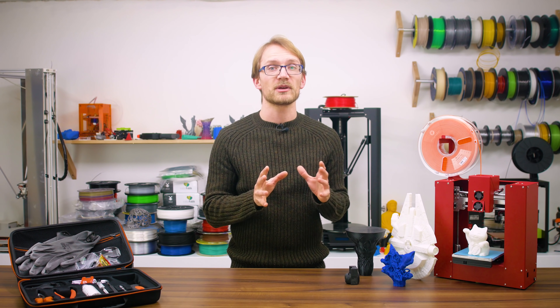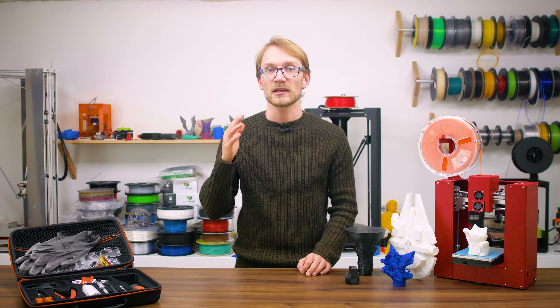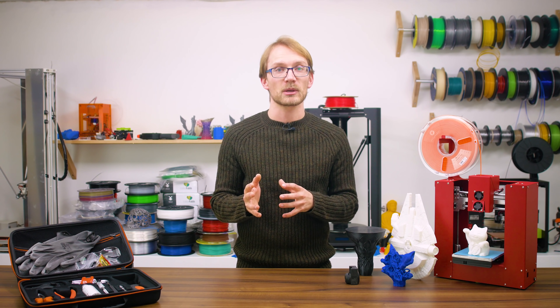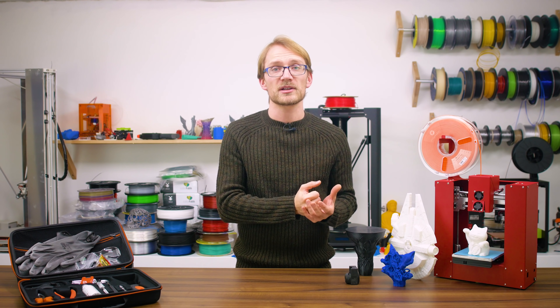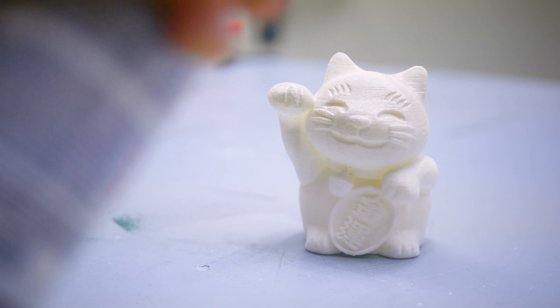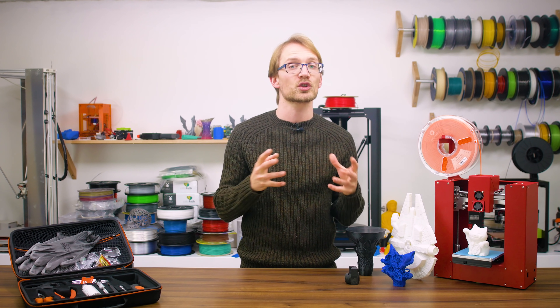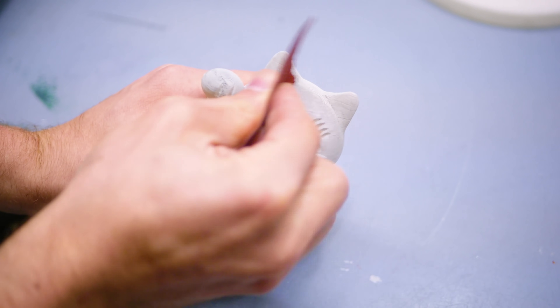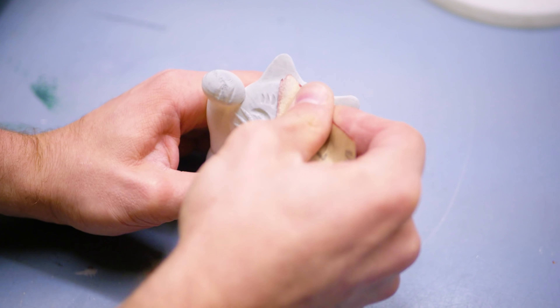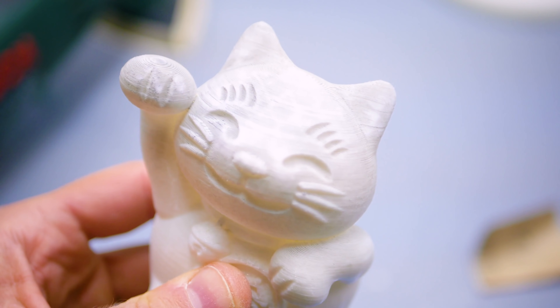Almost all materials can be painted — nylon again being the one that sticks out, and PET won't give the part that much grip, but as long as you're not hammering the part you should still be fine. Starting with a filler primer, the standard auto parts rattle cans are actually a pretty good choice here. After each filler pass, give it enough time to cure and then sand it down until you can see the base plastic poking through. Wet sanding is a good idea to help with cooling the surface and to get a better surface finish.